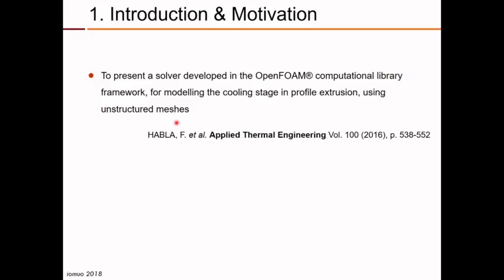There are a great number of parameters to consider. For example, we can have just one calibrator in the calibration system, or two or three calibrators in series as we will see in the case study. We can have several cooling channels with different numbers and different layouts. The water can be at different temperatures in each calibrator. We can have different lengths for each calibrator and different distances between them. So we have a lot to play with in order to optimize these systems.